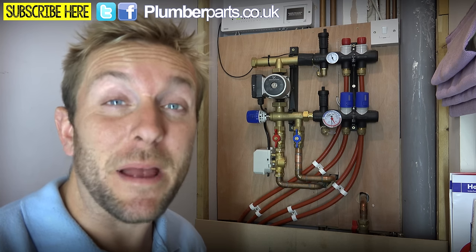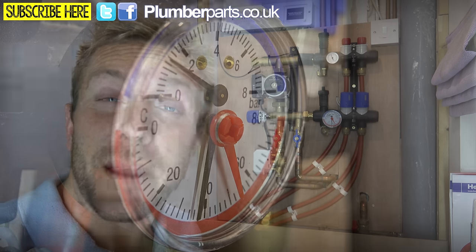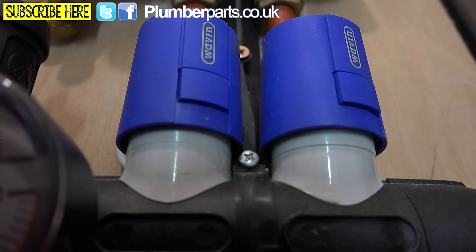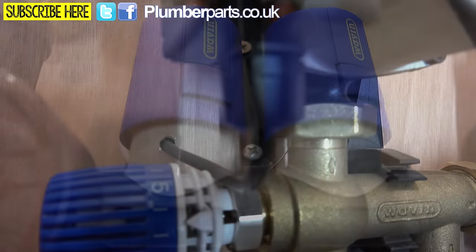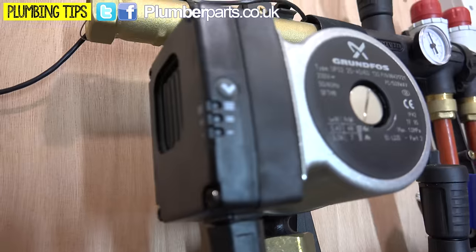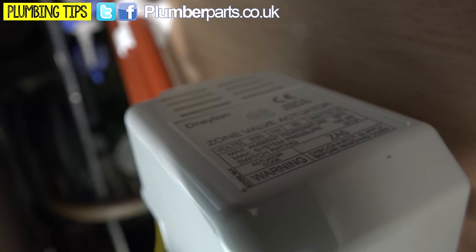And as you can see, we've made the best of a pretty bad situation, but we've managed to get this system in, making it look nice with a lovely little bit of plywood across the back there. It gives the whole installation a nice neat appearance. And also, if you look closely, you can see that we've hidden most of our wires that lead to our head actuators and to our pump and also to our two port valve. They're all hidden away behind there. They can't get pulled about or anything.